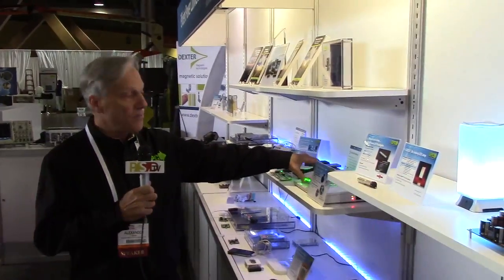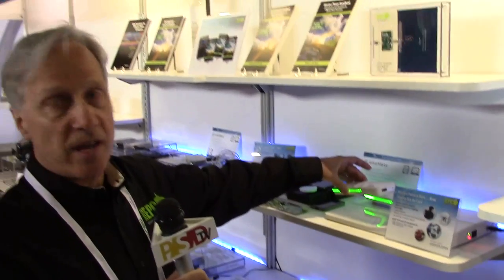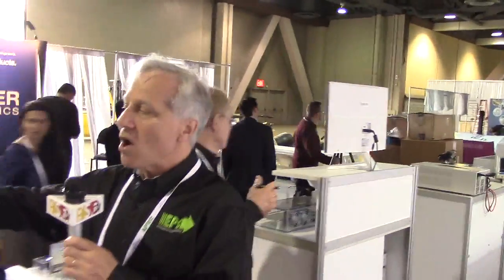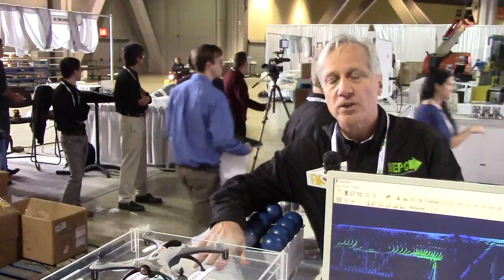Now, if you really want to go longer distances, you've got a different mode. You can use capacitive coupling, such as used by Solus Power, and you can see a little bit longer distance. It runs at 13.56 megahertz, of course using GaN FETs, and the magnificent things that you can do with this just are endless. So if you just turn around here and take a look, here's a drone that is actually flying above the system for charging it. So it's actually refueling in midair.